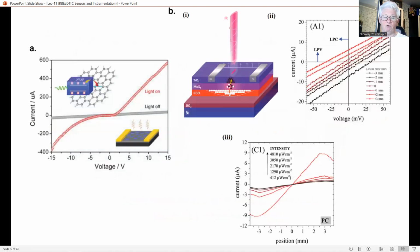Another particular application of an optical force measuring system is the online measurement of two-dimensional force on a pen for the purpose of signature verification. The force on the pen tip is transferred to the other end of the ink channel, which can move relative to the pen holder. A small mirror mounted on the end side of the ink channel modulates the direction of the laser beam, falling on a quadrant photodiode. From the 4 photocurrents, the 2D horizontal force on the pen tip can be reconstructed. Since the transfer from the force via mirror displacement to the photocurrent is rather complex, the device needs to be calibrated. Experiments prove the feasibility of the optical method.